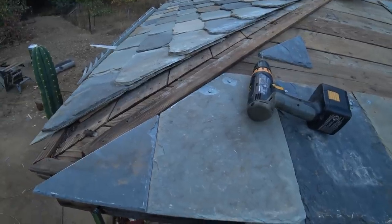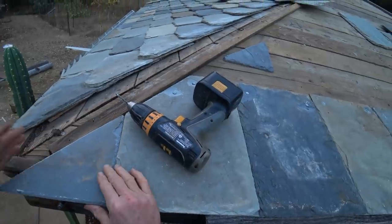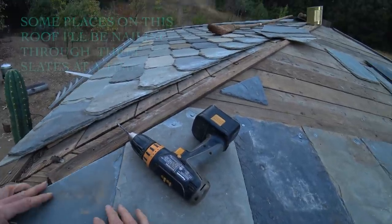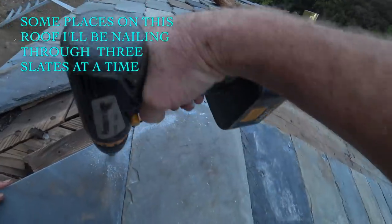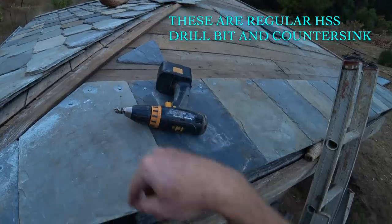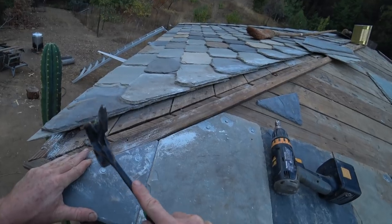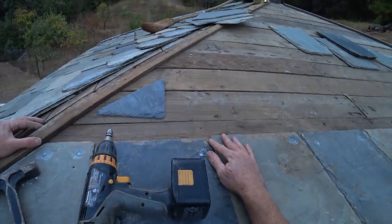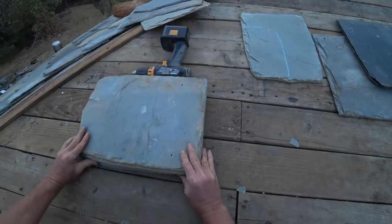It's occasionally handy to have a drill and a countersink for situations like this. Even if I could punch this slate - it's a little bit small so it's going to be a little more fragile - there's a slate underneath it that I'd have to go through too. I can just line everything up. This is going to trash your countersink and your drill bit, but I've used this one on this whole roof and another roof and it's still working, just really dull. One more to put on the other side and then the starter courses are done.